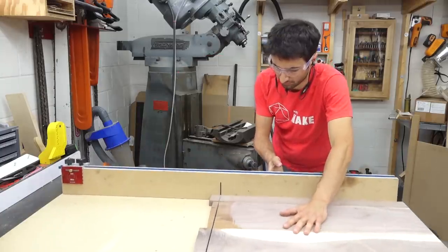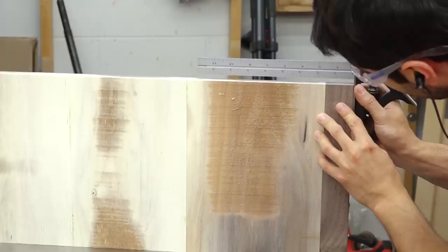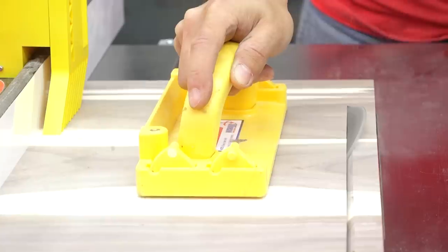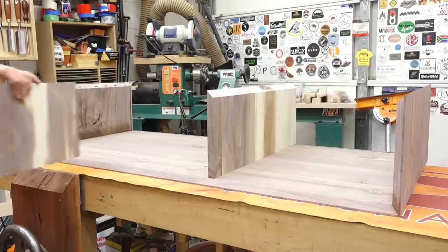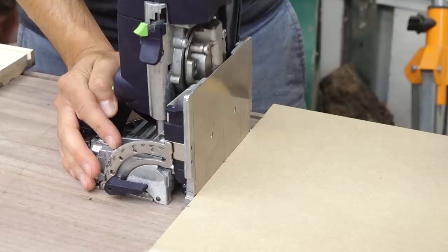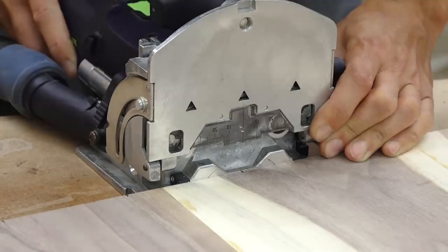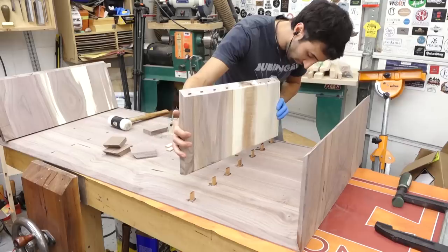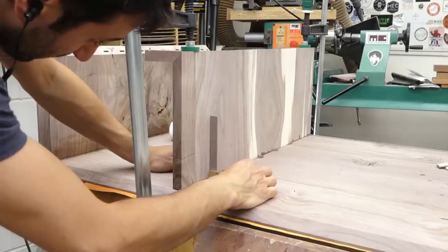Continuing on with the case construction, I'll add the vertical components which will frame out the drawer cavities. These have their front edge bevel detail removed, and then I can rough cut them to length. I'll verify the cuts are nice and square and make any tweaks as necessary, then cut a 45-degree bevel on one end to get exactly the same height as the case sides. With all the cuts on these tall dividers complete, they can be joined to the case. Dominos again here, using a piece of MDF with parallel edges to place the divider parallel to the side of the case. Epoxy again as my slow-setting adhesive of choice, some clamps and a square to check for square.